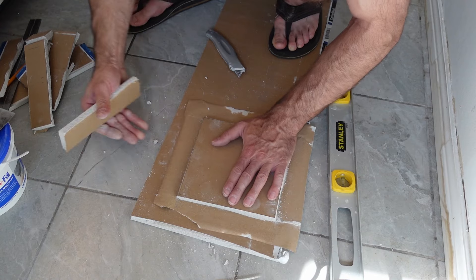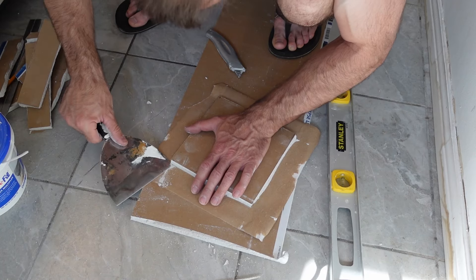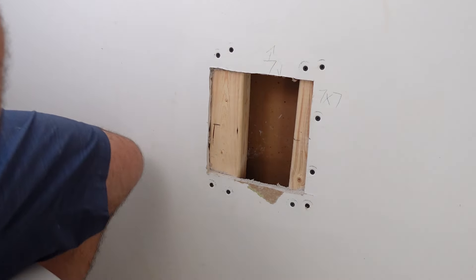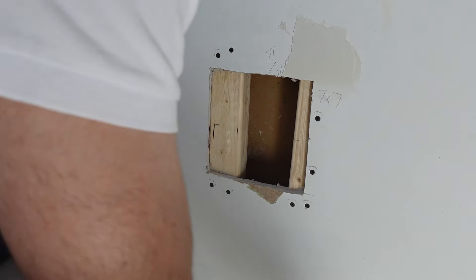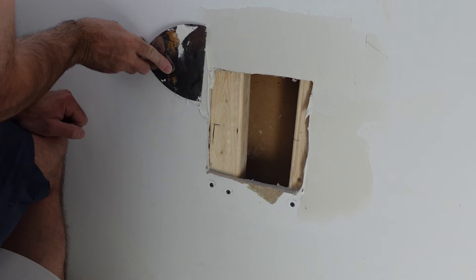One of the big things you want to do is make sure there's no drywall material left on that face paper, otherwise it won't sit flat on the wall — that's the worst case scenario. Get everything off that face paper that you can, then do some test fits to make sure it fits right so you're not messing around when you have actual mud on the wall. Once you're happy everything will sit flush, grab the drywall compound and put that on the wall before inserting the patch. The purpose of the drywall compound now is to provide something for the face paper flaps to stick to — it will hold that paper down to the wall.